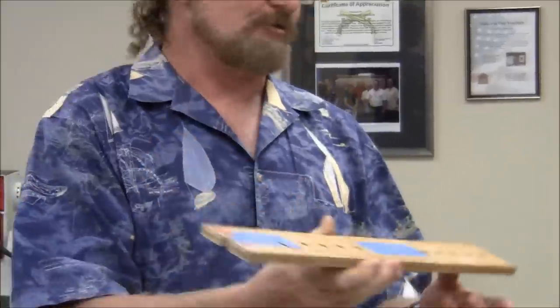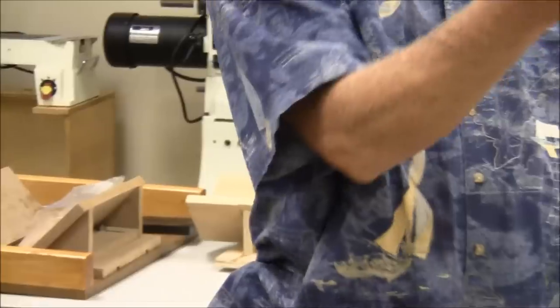That's for adjustable shelving. Before these things were commercially available, I just drilled a series of holes 32 millimeters apart. I've got my router set up with a bushing with a 5 millimeter bit that I had to modify on a drill press because it came off of one of those master things that would drill like 90 million holes at once. I had to chuck it in the drill press and round it up so it would chuck into the router, which is higher RPMs than the tool's supposed to be rated for. But you know, it's worked fine for probably 12 years or better now.